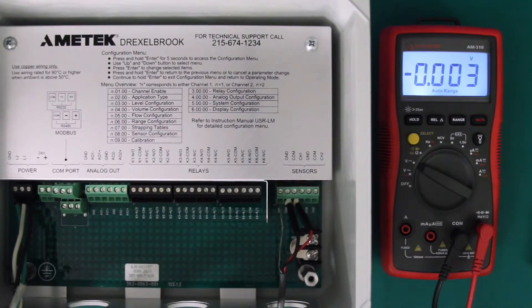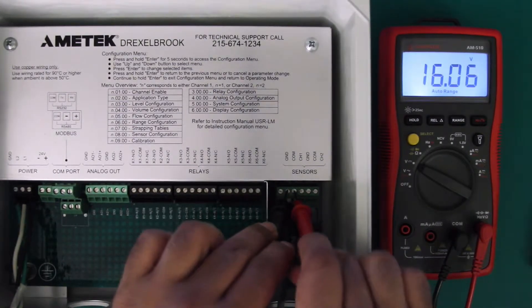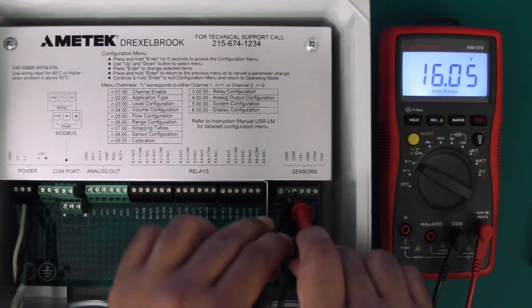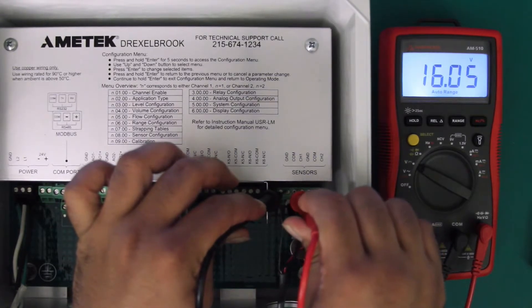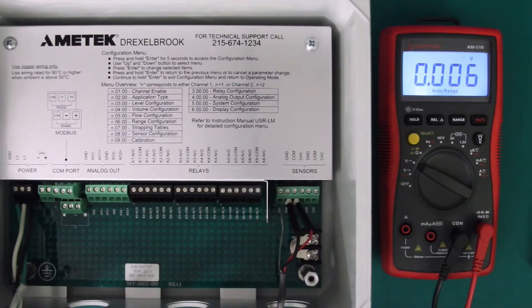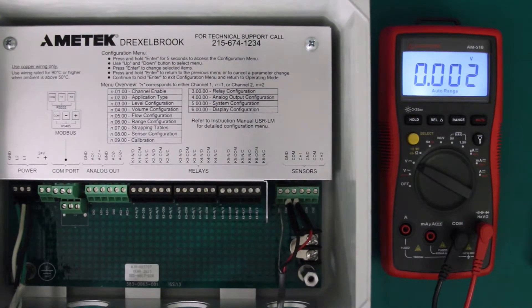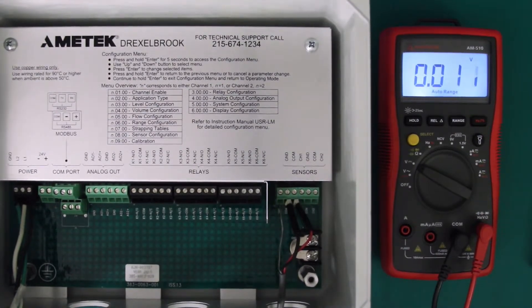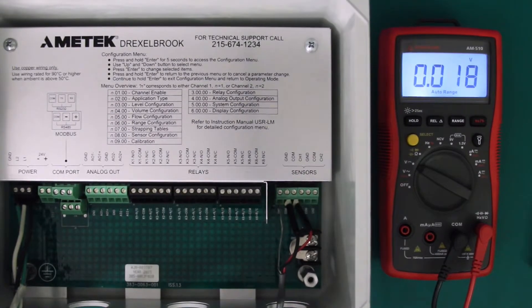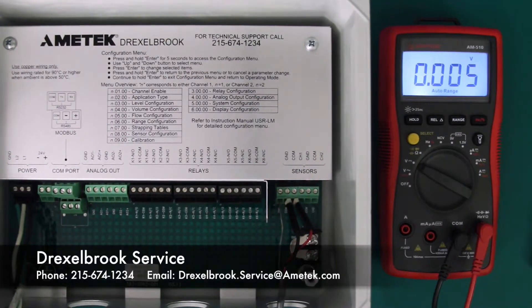Now that our sensor is connected, we're going to do one last voltage check. The two terminals should be between 14 and 17 volts DC, and we're getting 16 volts, so since our voltages are in the correct range, that means our sensor is communicating properly with our motherboard. If you experience any voltage readings outside of the normal indicated range, this may indicate an issue with communications to or from the sensors. We highly advise you to contact our service department at the phone number or email address shown on screen, and one of our technicians will be happy to assist you. We hope you've enjoyed this tutorial — thanks for watching.